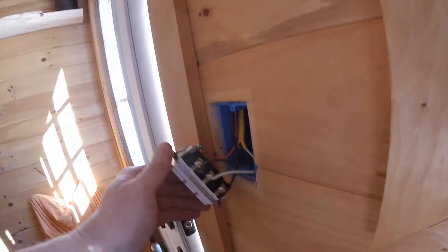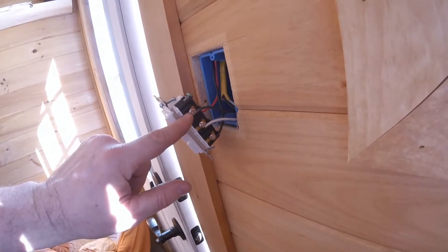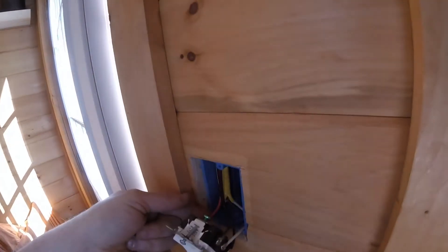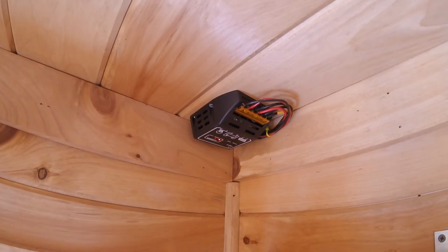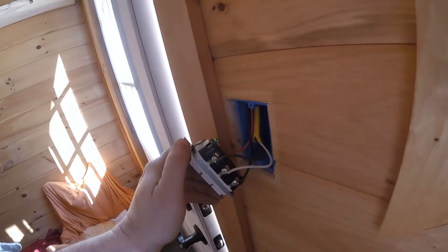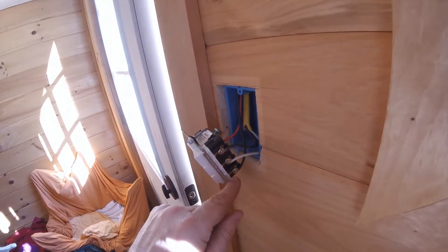This switch has three switches built in, making the whole side hot. The other side has three wires — one from each switch goes to each light. The top switch controls the light up here — hit it on and we have light, turn it off. The second switch gives us the second light. So to recap: power from the panel comes into the control box, the battery comes into the control box, and then the red wire for your lights comes to one side of your switch. There are three wires going one to each light: outside left, outside right, and inside the sauna.